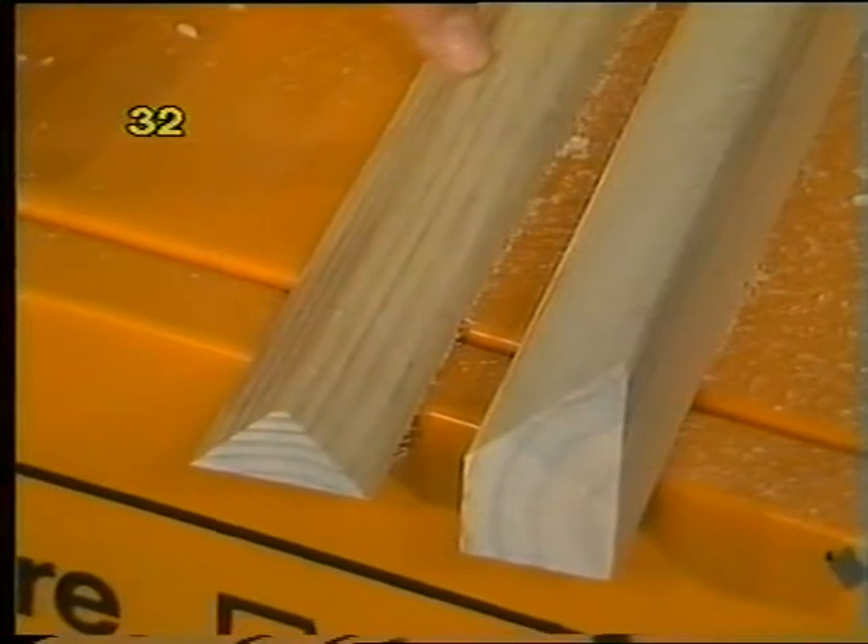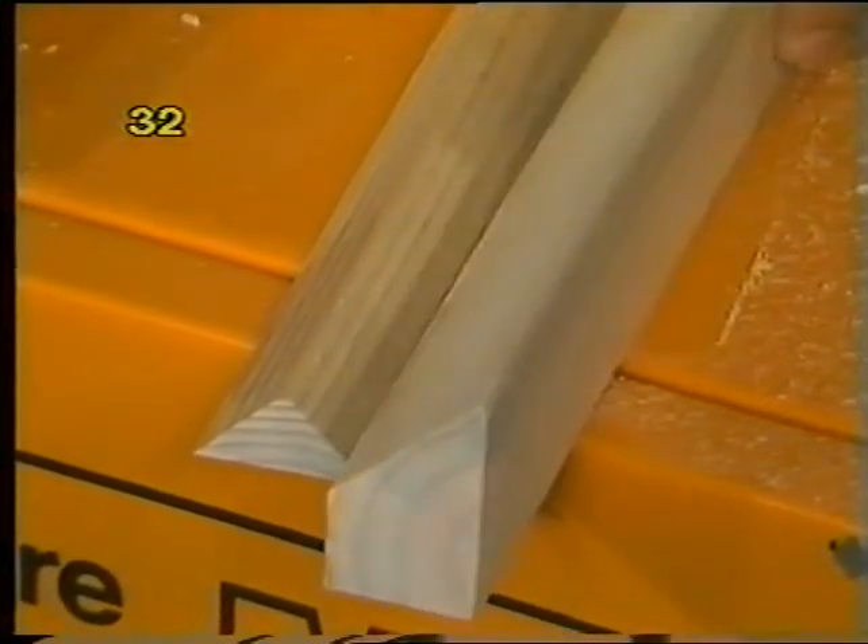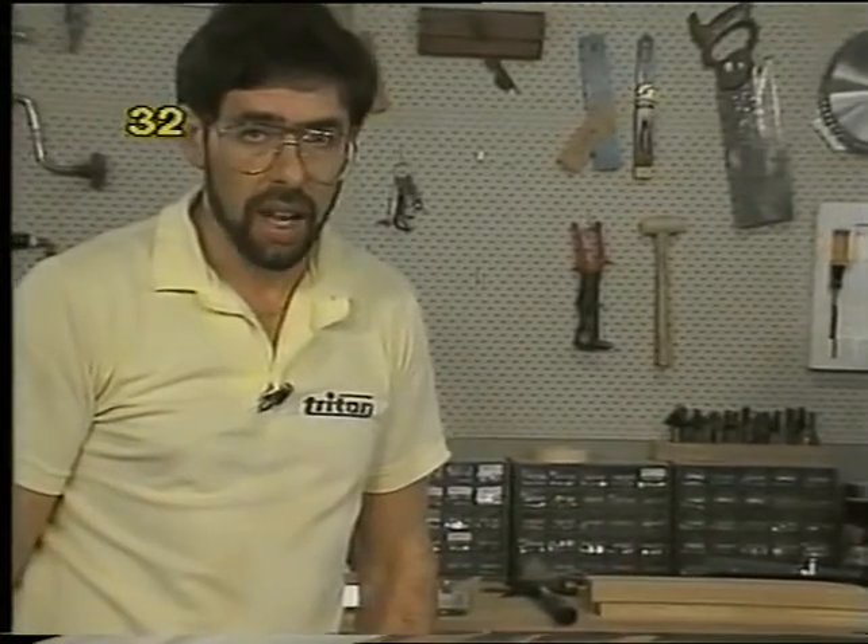It's also a very good means of making your own quad if you need to. The load on the saw is very high with this sort of cut, so adjust your feed rate accordingly. Don't overload your saw and make sure you've got a sharp blade.